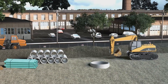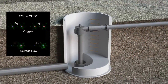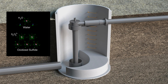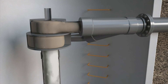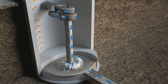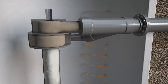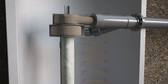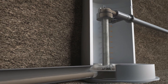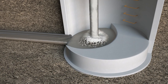The Vortex Force is an aeration device that draws in and powerfully mixes air into a sewage flow, transforming the anaerobic conditions that produce odors and oxidizing the H2S and other odor-producing compounds. The incoming flow is split into two streams — the upper vortex directs the flow clockwise while the lower vortex is counterclockwise. The two flows intersect at the drop pipe, creating an area of intense turbulence and mixing where air is drawn in and broken up into extremely small bubbles, maximizing surface area and allowing oxygen to quickly diffuse into the flow.